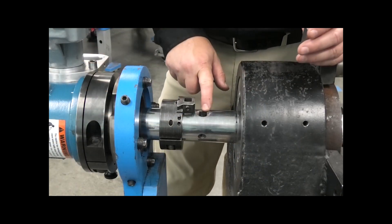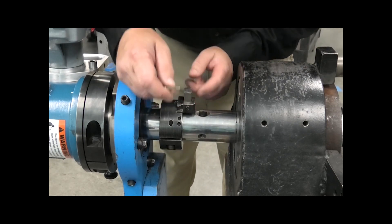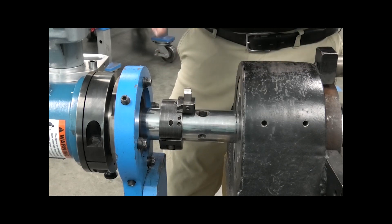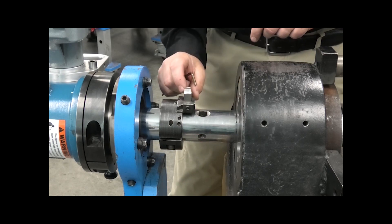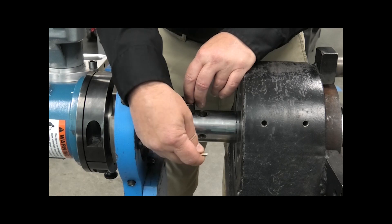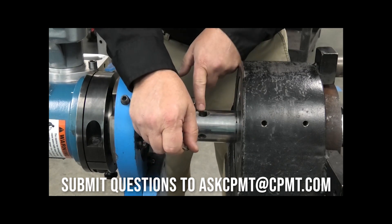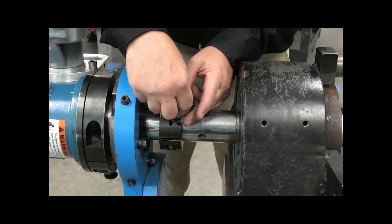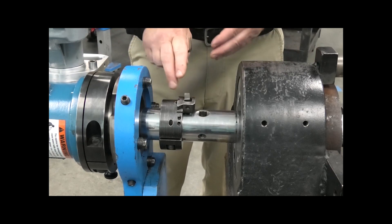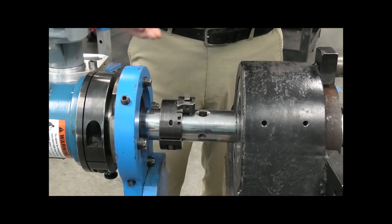Now I'm going to demonstrate how I don't necessarily have to have the tool bit going through the boring head into the bar. I can use a shorter tool bit — as long as it doesn't touch the bar — then lock it down and make a fine adjustment. It's not necessary to have a long tool bit going into the bar; I can use a short tool bit and move the boring head anywhere along the bar. Another really nice feature is that if I needed to, I can use a different size tool bit. Whereas with a standard tool bar it's more difficult to use smaller three-eighths tooling, with the boring head it fits just fine — it locks into the corner, I can lock it down, and now I can use three-eighths tooling inside the half-inch tool slot. Not something I want to do all the time, but it's a nice option to have as a trick in my tool bag.